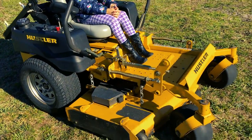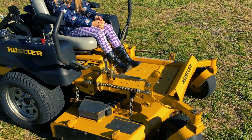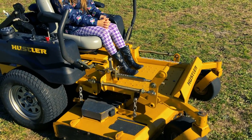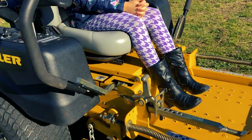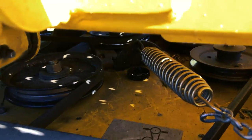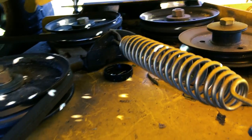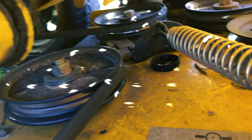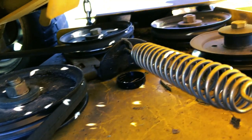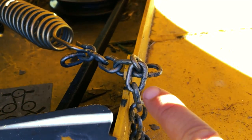The one thing - something that I have come to loathe about the design of the deck - is more the pulley. I cannot stand this. You see this spring that's notched and locked right here? That spring - the belt comes around from the PTO back there, and when you bump around in all of that, that spring, no matter how freaking tight you have it right here, pops off.